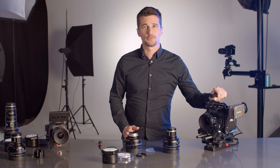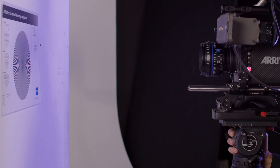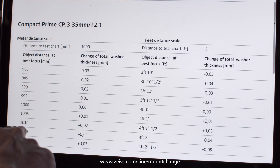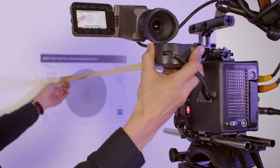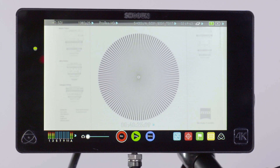To get started, put the lens on a camera and check if the back focus is correct. Attach a back focus chart to a wall and choose the correct testing distance appropriate for the CP3 lens you're using — make sure you're pointed straight at the focusing chart. The correct testing distances for each CP3 lens are described in the Zeiss mount change instructions document. Open the aperture all the way, set the focus on the lens barrel to the measured distance, then check on your camera if the test chart is fully in focus.